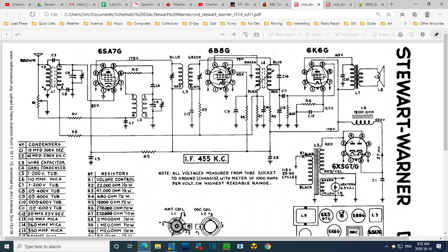Like why wouldn't you use this other diode here? I think this diode in the circuit, here you can see it's just grounded. It's kind of odd too, because the current flow in here is coming off of here. Wait a minute, how is this detected? What's coming through here is the full-blown output of this tube. Usually these tubes are arranged so the detected signal is sent through the amplifier. You detect it or rectify it and then send it through. Am I just reading this all wrong?